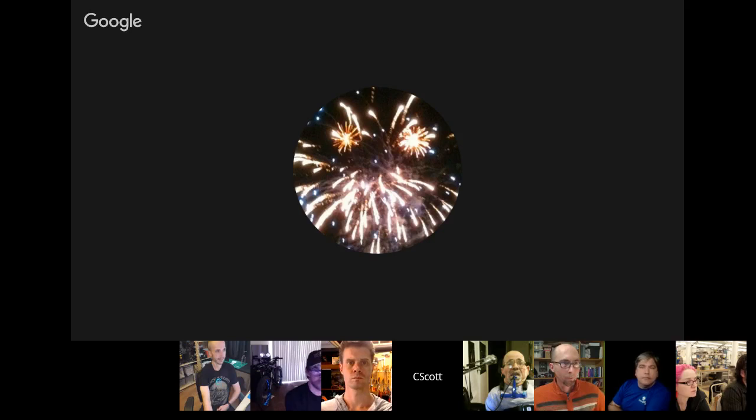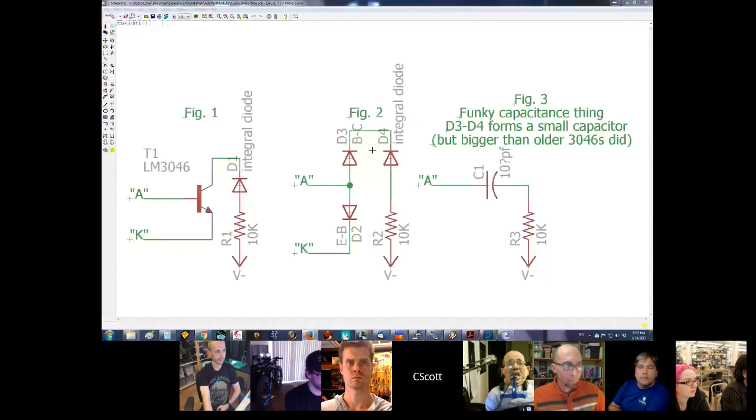So that this capacitance was so high, it was biasing this diode on, this one, the base collector junction, through the capacitor, because the AC impedance had gotten low enough that I was seeing a full voltage drop, and I shouldn't even see the diode being turned on at low control current. We're talking like picoampere control on it, like 250 picoamperes or nanoamperes.